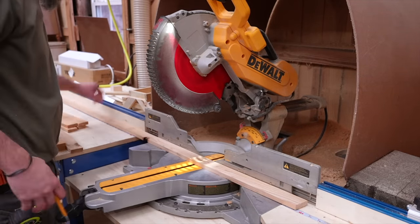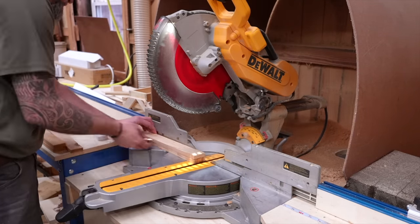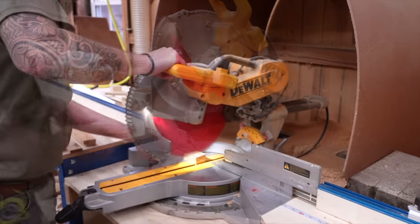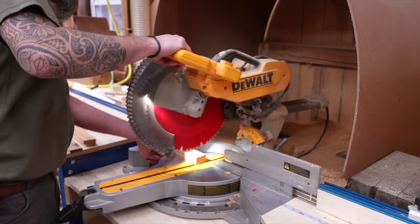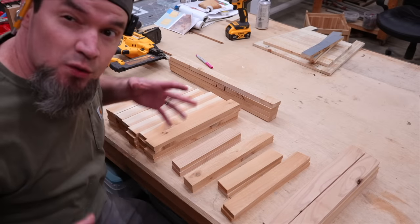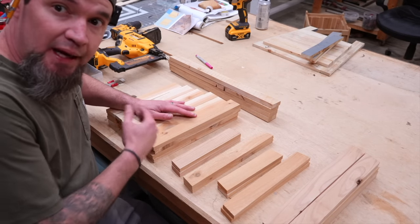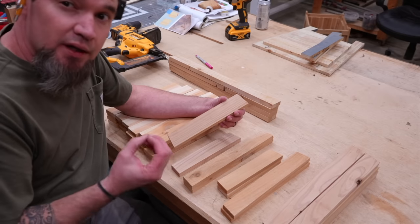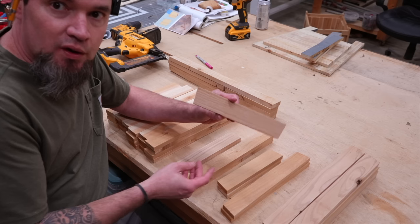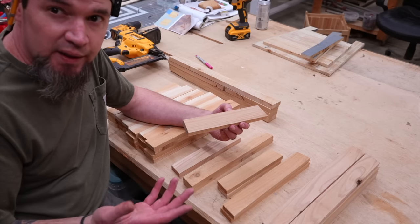As an example, I'm cutting my leg boards now. I'll put an eight degree cut on one end, slide the board down, and make another eight degree cut on the opposite end. For the top boards, I put eight degrees on one end, flip the board over, and put eight degrees on the opposite end. Now all our parts are cut — some I just square cut and will add the angle in a moment. Every angle in this build is at eight degrees, and I'm showing you both ways of doing it.